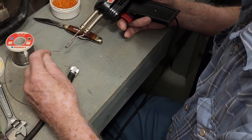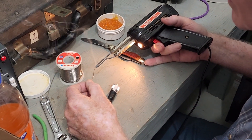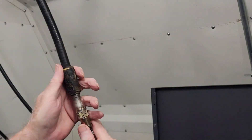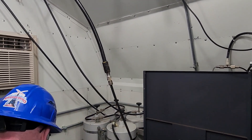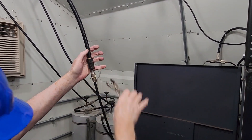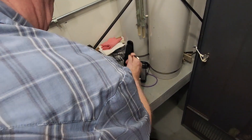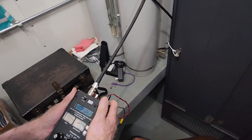Remember, we're having a problem with the receive, not the transmit. So something about 146.280 at our input frequency — that's where we're experiencing the biggest problem. As far as the cabling and the antenna, the SWR looks really good. But we're going to actually have to use our radios ultimately to see if it's any better on the receive. There's the Weller soldering iron that AC4DM swears by, and we're going to finish up making this cable. Now we're going to attach this slightly shorter cable to the hard line, and then attach this to the T-connector on the duplexers. The duplexers — you've got four cavities there working in pairs — an input frequency and an output frequency — to give you separation and rejection between the 146.880 frequency and the 146.280 frequency so you can use one antenna.